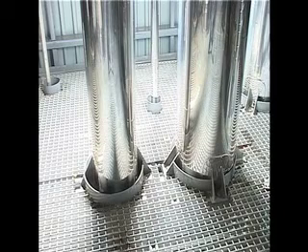The oil is then fed into a storage tank where we do water degumming, and after the degumming it is pumped into the crude oil storage tanks, which is then ready for refining.